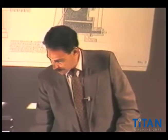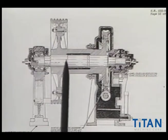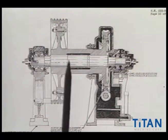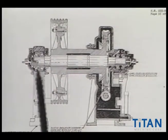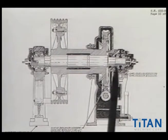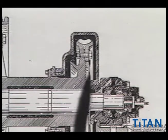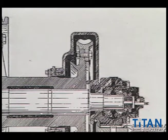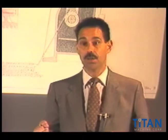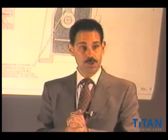This also shows another area, and the views we have here are beautiful. You can see that this particular situation, it being a live shaft, means you could get a certain amount of lost motion with this machine as well — the shaft could break away and you could get some slop inside those bearings. There could be a whole host of problems. This also shows some other areas that are very far-fetched, but we have seen it happen. There are times when the fit between the gear and the spider — and this shows it very nicely — there is a very, very close interference fit between gears and spiders. The gears are actually made smaller than the spider so that when you put them on, you have to heat them up in order to mount them. When they cool down to the same temperature as the spider, it acts as one member.